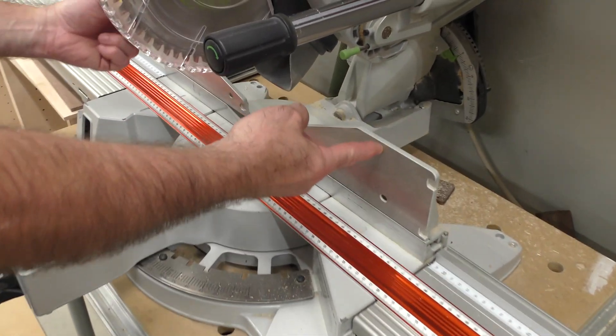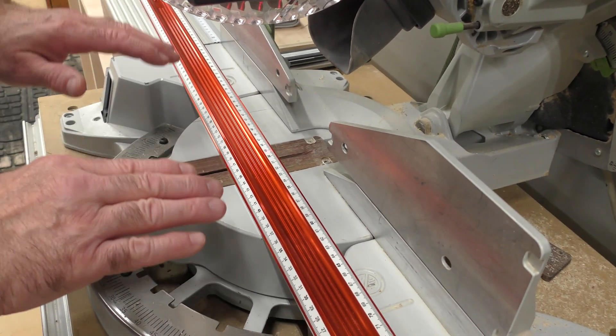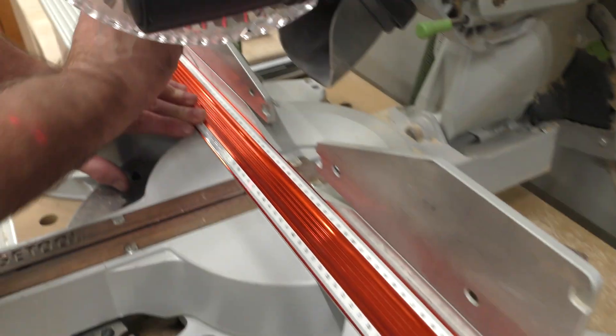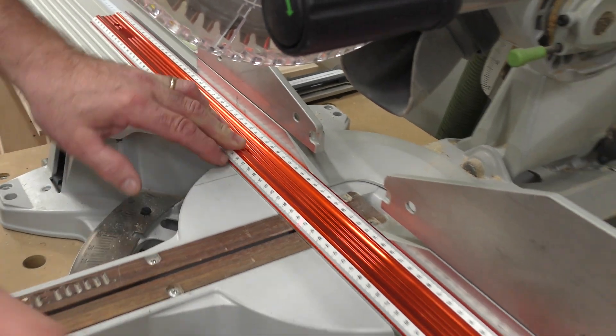A typical application of a precision straight edge is to check for flatness on your machinery. When people are getting a miscut, I ask: did you check your fence? I'm not talking about the top pieces — I'm talking about the small pieces below. First I'll clean out any debris, then bring my straight edge. A straight edge takes your eyes out of the mix. I grab my feeler gauge and check — that's perfect. Where you want to check is right in the middle — still dead on. That's going to give me an accurate cut.